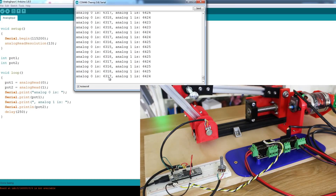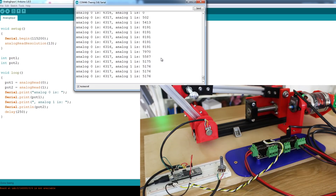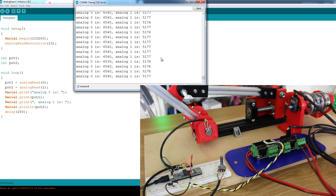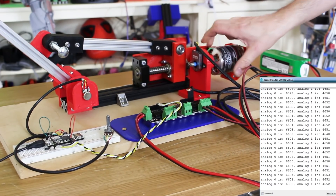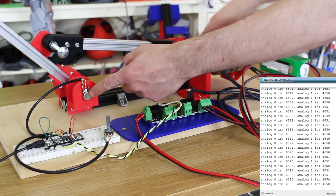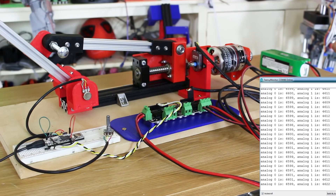The pots are still and you can see there's a bit of jitter, but at this high resolution it's quite insignificant. Now if I turn one of the pots, we can see that value moving all the way down to zero and all the way up to 8191. Now I've powered up the ODrive — just using the stock Arduino code which initializes the motor and does motor tests — and the motor now has holding power. I've calibrated it for 40 amps of holding power, up from the default 10, so there's quite a lot of holding power to spring the thing back. You can see the pot still moving as I move the joint, and there's still about the same amount of jitter, so hopefully the screened cable is working.